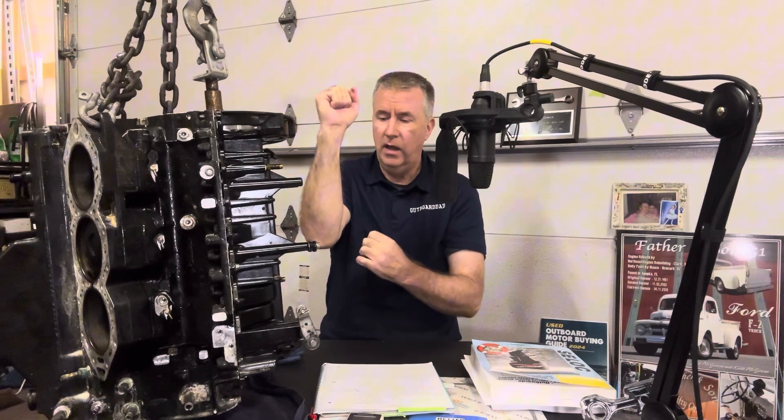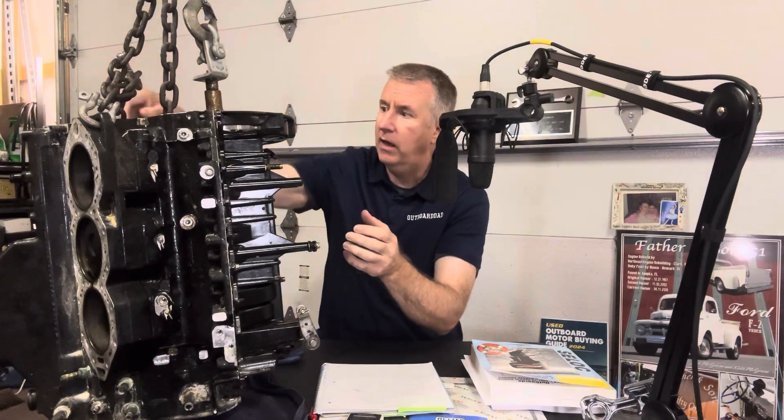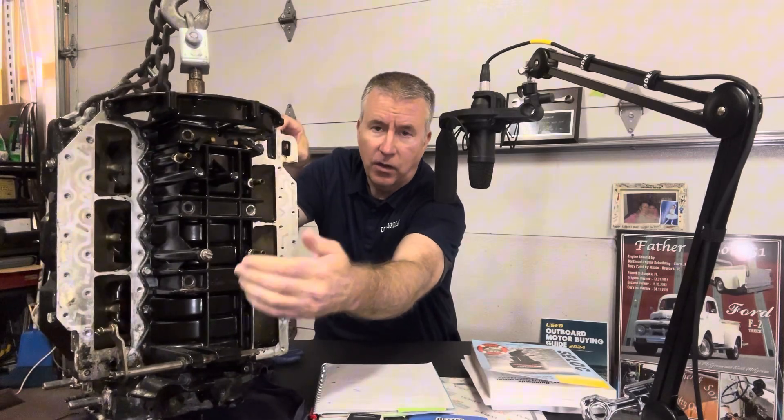The piston goes up in the cylinder, causing a suction to pull through the reed plates. The reed plates are only one-way valves, almost like a check valve, and that fuel and air mixture goes into the crankcase. Here's our crankshaft right here — you can see the connecting rods going up and down, and all of that gets lubricated with the two-stroke oil that we mix with our gas. This particular one is direct injected, so it has a separate oil pump that pumps from a tank in your boat and pumps that oil directly with the injectors, as well as into this intake side to lubricate everything, although it still ends up in the cylinder to be burned.